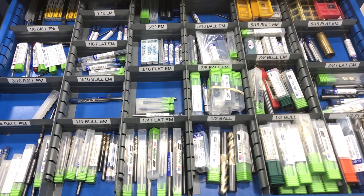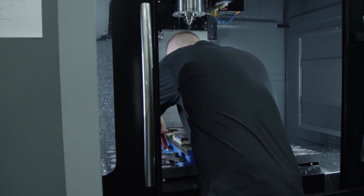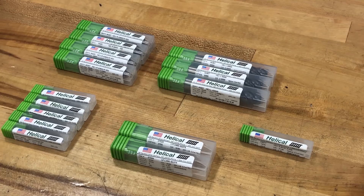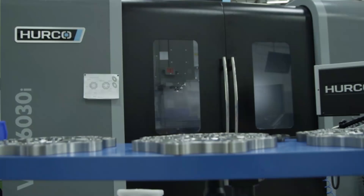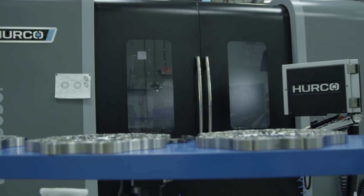All of that comes from Dolan's experience with them and knowing how quickly they can turn those parts around. One of the parts we developed last year — we had a face milling operation that was taking a significant amount of time. It's in a 4000-series material, and we just thought, let's just try it — take an HEV5 and go full depth cut and remove as much material as we can and see what happens. Sure enough, that ended up being a time savings of at least 25 minutes for that part. We were getting about 600 minutes easy out of that tool, and that was removing a significant amount of material. That was the moment when we started to utilize that type of concept on more parts.